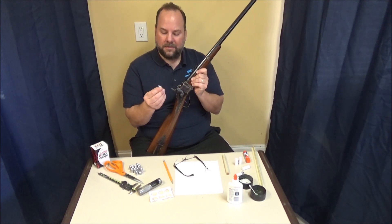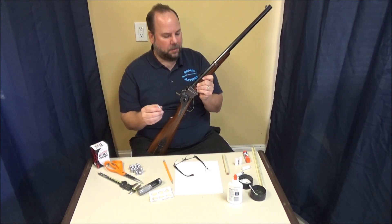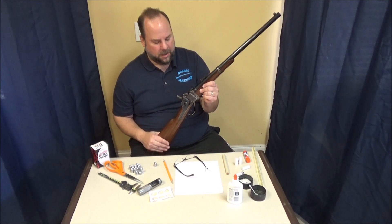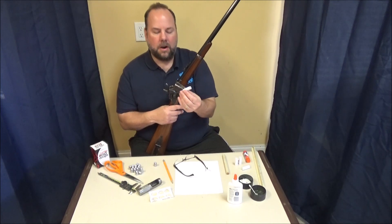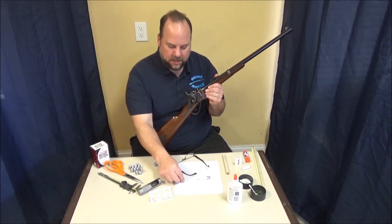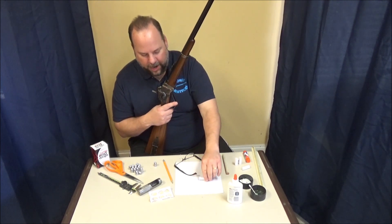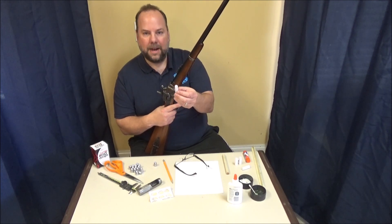What this is, is a very close copy of a historical Confederate Sharps carbine bullet, and we're going to figure out how to make a combustible cartridge that uses it. Unlike the historical cartridge that had a folded tail sheared off by the breech block when it rose up, we're going to make an ahistorical design — one that was historical for other types of Sharps carbine cartridges — that has a flat back.